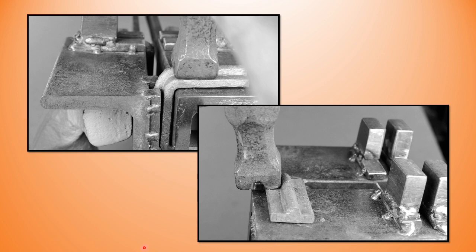So I'm showing my set hammer here to do this, but I make the bend and then I'm going to crisp up the corners. If the material is slightly twisted, it's going one way or the other. Generally that means I've got a little piece of air under here, and I need to get rid of that to straighten the collar out. So I take my set hammer, close that, hit it, closing that piece of air down, and that's going to move the collar material the other way. To do that and to protect that transition between the back strap and the bead material, remember I've got a soft transition here, you can see I've got a nice soft transition on either side of my set hammer.